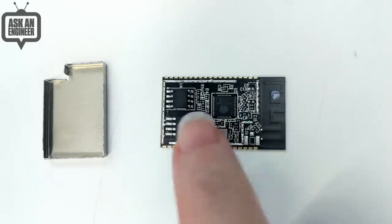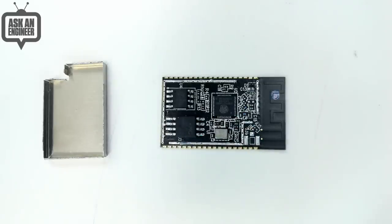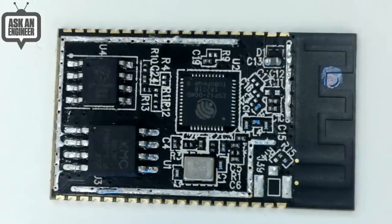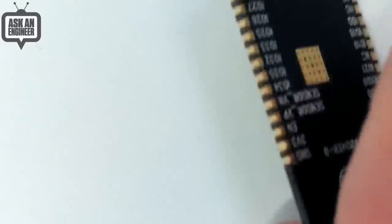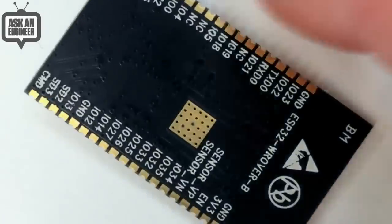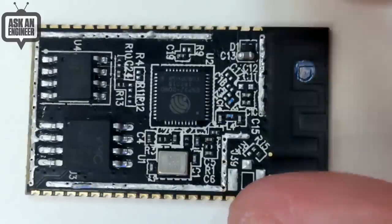There are a couple of projects people like to build where you need extra RAM, like video game emulators. If you want it to be a Game Boy emulator, you need to buffer a ton of stuff in RAM. This PSRAM will be very handy. So it's a longer module with the same pinouts — they moved it from being shorter with pins on the side, and now the pins are all along two halves to make room for this PSRAM chip.